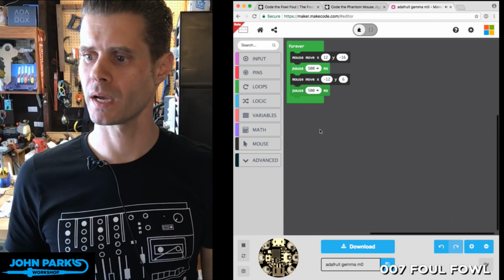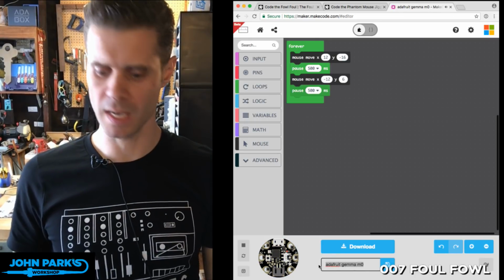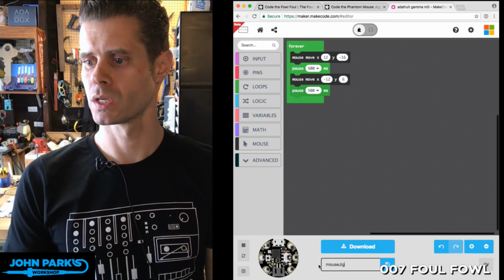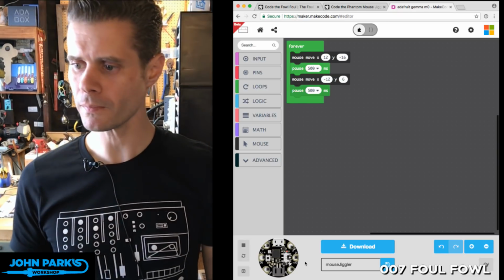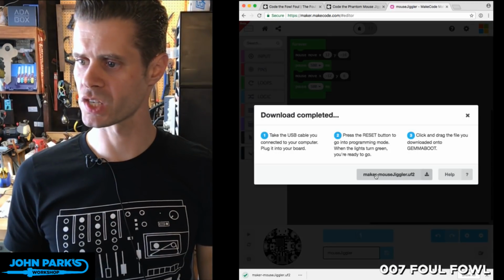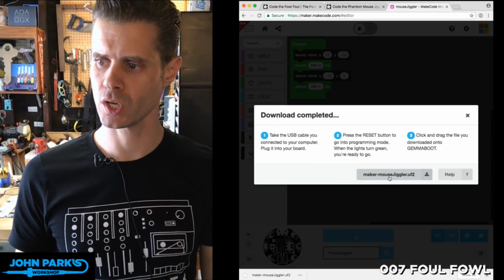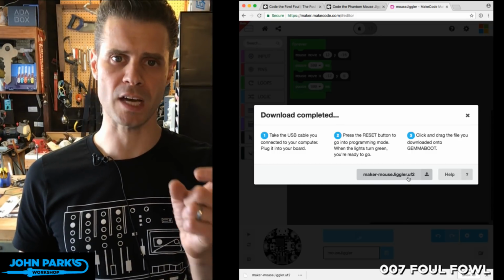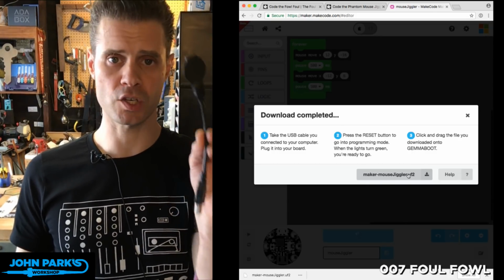Pause. Okay, so now what I'm going to do is I'm going to give this a name down here. I'll call this Mouse Jiggler. And I'm going to download the code for that. So this is the file it's going to save, maker-mousejiggler.uf2. And this is the universal flash format, which is a file that I can just drag onto the board.